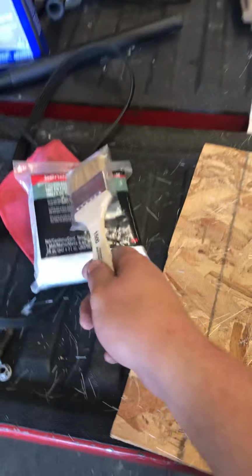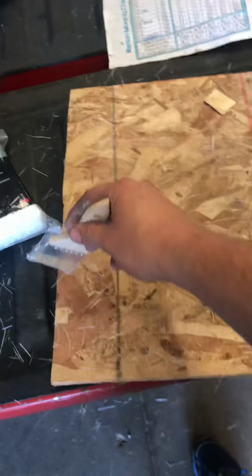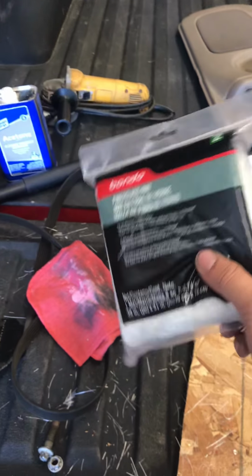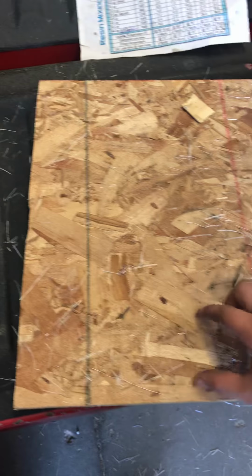What we're going to do, if we were fiberglassing this particular size panel, is cut 4-inch-ish pieces. This doesn't have to be exact science. 4-inch by 4-inch squares. Get a bunch of those. I do this personally before I even start mixing resin. I'll open this whole package up and literally cut the whole thing into little squares or little strips or something like that.